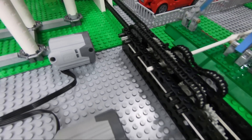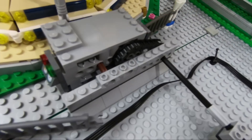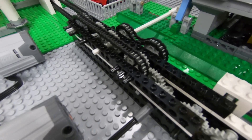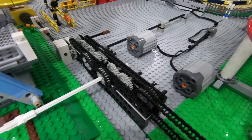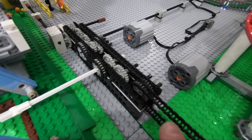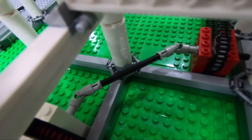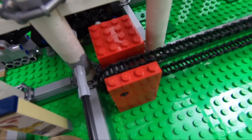The roller coaster does take quite a bit of power, but that's how we set this up. We go across here with this axle — I think that's a 12-tooth to a 24-tooth gear. I don't know all the exact ratios; Josh and I just did trial and error until it was working. On the other side, there are two 24-tooth gears running off that motor at the same speed, going into a 24-tooth gear receiving that chain, turning two angled axles — and that goes right into yet another 24-tooth gear turning the chain into this little box right here.